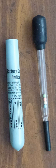The state of charge of a lead acid battery can be estimated from the density of the sulfuric acid solution used as electrolyte. A hydrometer calibrated to read specific gravity relative to water at 60 degrees Fahrenheit (16 degrees Celsius) is a standard tool for servicing automobile batteries, and tables are used to correct the reading to the standard temperature. Hydrometers are also used for maintenance of wet-cell nickel-cadmium batteries to ensure the electrolyte is of the proper strength. A battery hydrometer with thermometer (thermohydrometer) measures the temperature-compensated specific gravity and electrolyte temperature.